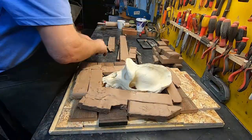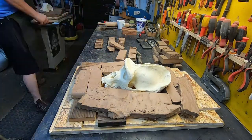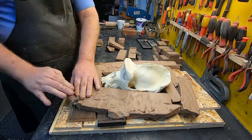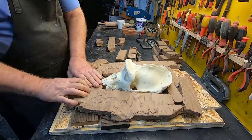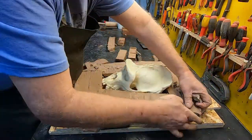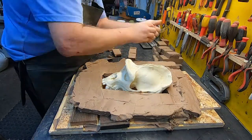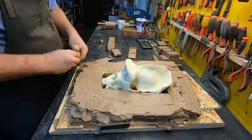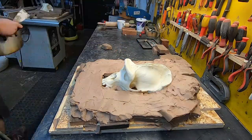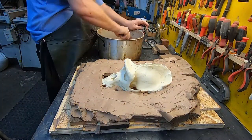Make the clay bed at least around 100 mm wide around the object. Work the clay into a flat, even, smooth surface all the way around. I use clay that I melted earlier and let cool down, to make the spreading of the clay easier.